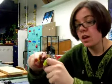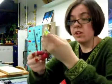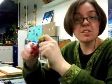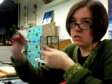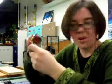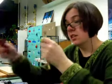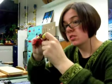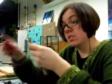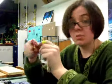We're about halfway through this project. We've got the blades made, the tang's almost finished, and five injured fingers on top of it — all in the course of about 30 to 40 hours. Tomorrow, if I get this done, I think we're going to heat it up and quench it. That's the part I'm most scared of, because that's where it's most likely to break. It's minimized by the fact that we're using oil and I'm using non-forged steel, but it's still a big risk.